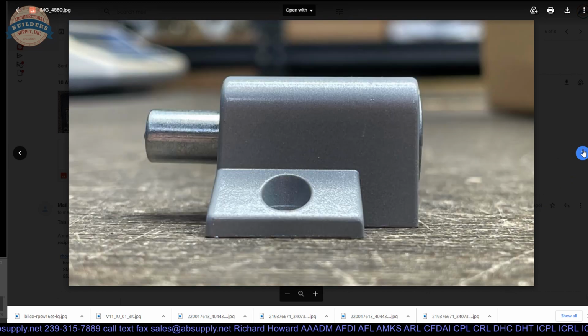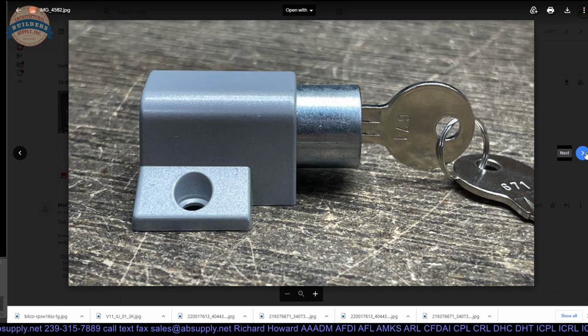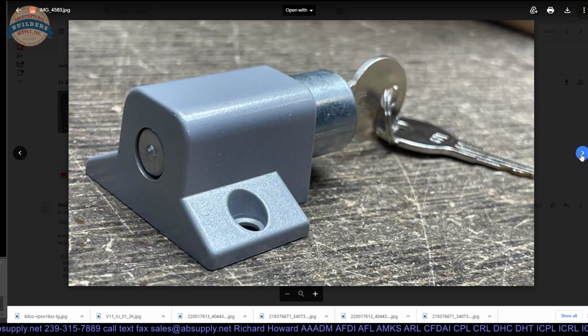side view, obviously. The cylinder. This is a wafer tumbler lock. There are flat pieces of steel in there that have differing internal cuts. And the depth of those, or the height of those cuts directly relate to the cuts on the key. This won't be a video on wafer cylinder technology, but wafer tumblers are one of the primary types of tumbler technology versus pin tumbler and lever tumbler. The key installed, the bolt retracted. There's another view.